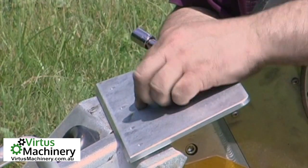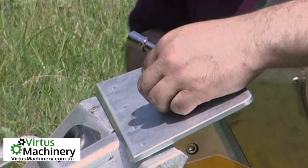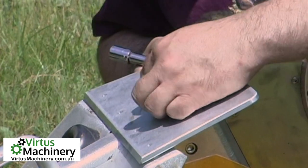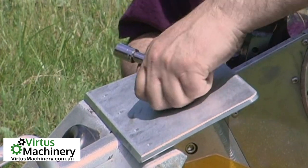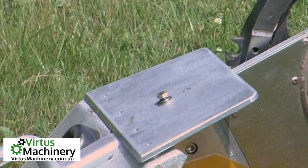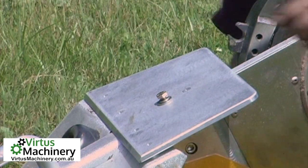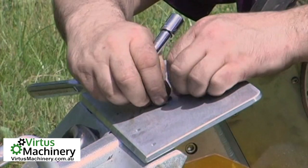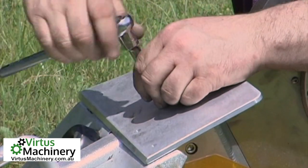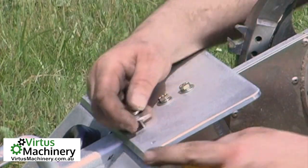So obviously you've got to have plywood or some kind of a tarp up, just something to keep from throwing debris out in front of the machine. I don't care if it's a piece of plywood or a tarp, just something. That helps to limit your liability. But in this case, you can see how much more visibility you have by putting this plate on. This is great both for trenching 12 inches deep and for stump grinding when you need maximum visibility.